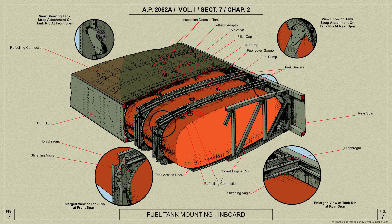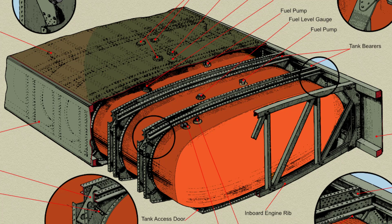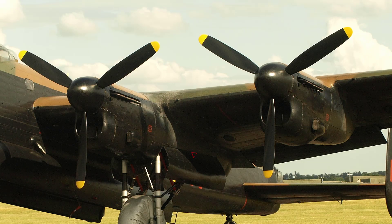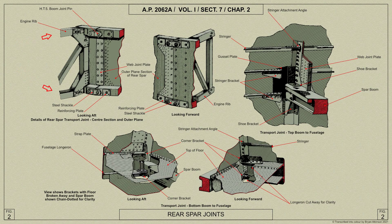The flanges follow the upper contour of the tank. The front ends of the ribs are shaped to receive the nose of the tank, the rear end being cut away to allow the tank to be lowered when the straps supporting it are released. The ribs are cut out from the top hat section stringers which strengthen the skin above the tank. A large assembly door stiffened with top hat section stiffeners is fitted in the bottom surface of the center plane to enable the tank to be removed. Outboard of each fuel tank is the engine nacelle, which also houses the undercarriage main wheel units when retracted. The undercarriage support beams are bolted to the front spar, which is braced to the rear spar at this point by two engine mounting ribs.